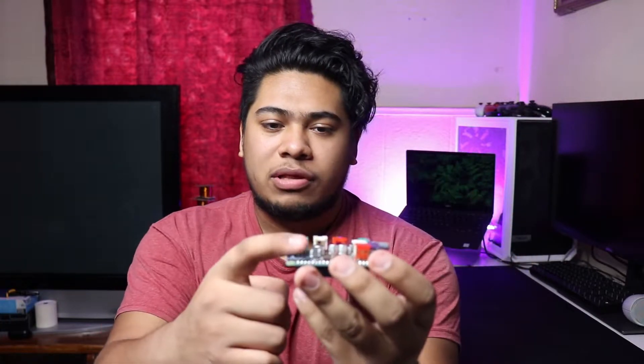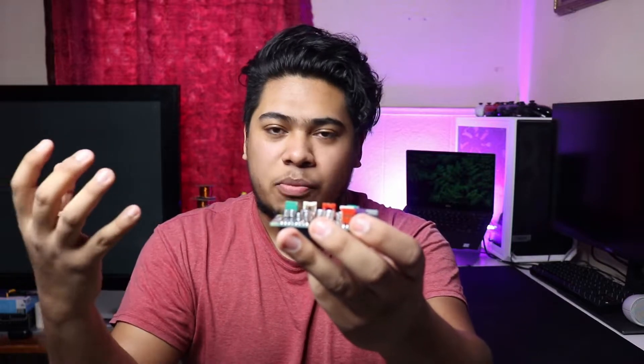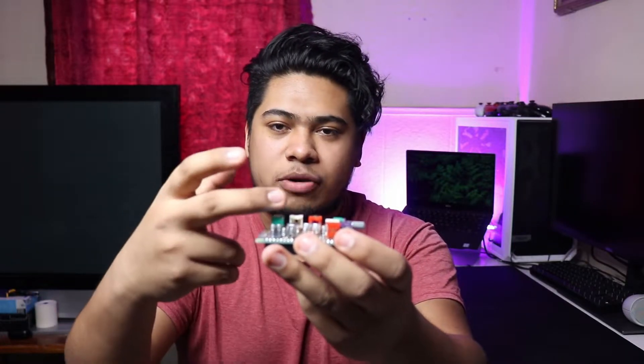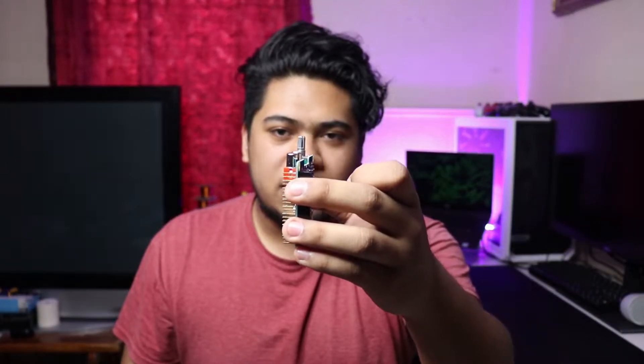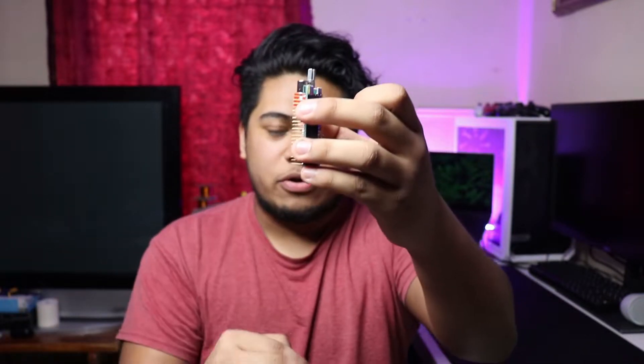Something I realized is that when I'm trying to talk to Karen while Karen is saying something, it becomes very difficult for Karen to understand me because there's a loud noise playing over it. Because of that, I thought the best solution would be to mount the microphone pointing up and the speaker pointing down, so they're opposite from one another. However, because this knob is here, I only get a 90-degree separation between the microphone and the speaker instead of 180 degrees, and I'm not sure that'll work well.